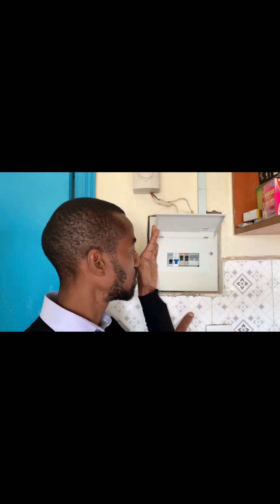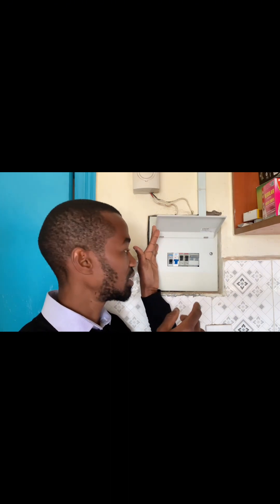For me to be able to change that socket, I first have to switch off that specific circuit, and I will do that at the consumer unit by turning down one MCB or circuit breaker. The issue is I'm not sure which circuit breaker is dedicated to that socket, so to be safe I have to switch off the main switch or the DP switch — basically the isolator — so the entire electrical installation of the house will be off. This will allow me to change the socket safely and avoid electric shock or a short circuit.